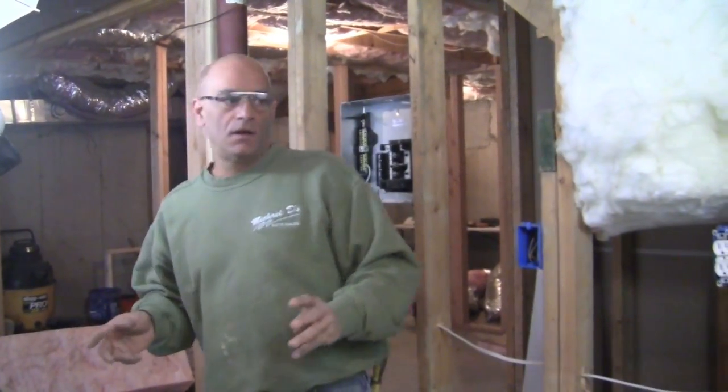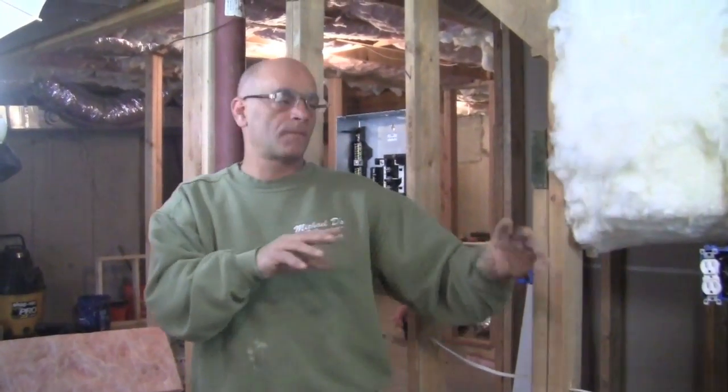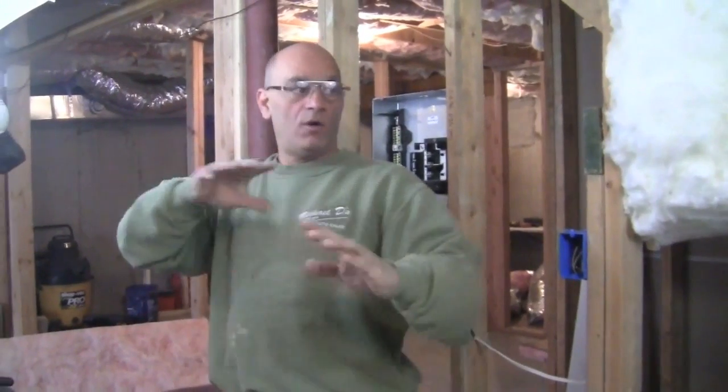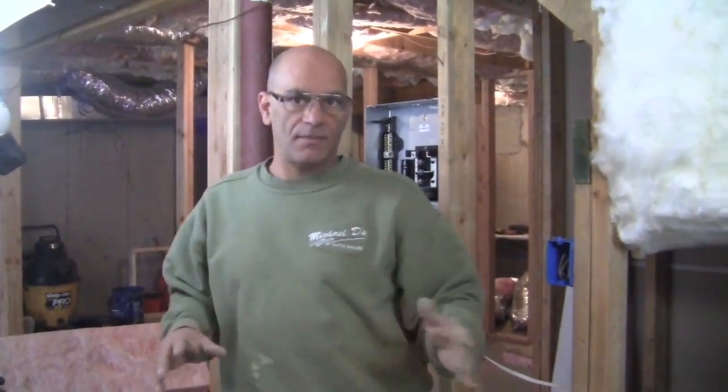Why do people always say 110, 120? Well, I'm not going to get so crazy on this. It's the variation of the voltage, of the drop. If you have a house that's close to the transformer, like really close, chances are you're going to be around 120. But if that same house is now 200 feet away and you don't have a transformer in between, well, it's just the voltage that drops. It's not a big deal. I mean, yeah, it's within specs. So don't ask me.